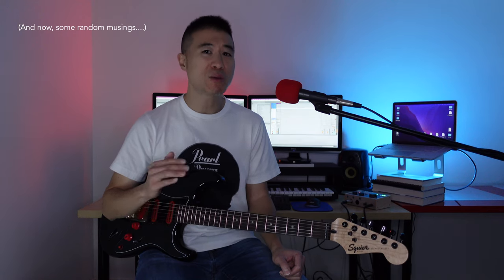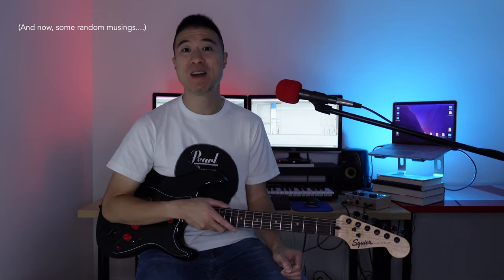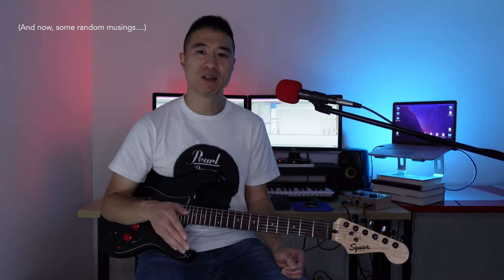The second thing is regarding copper shielding. I was initially under the impression that copper shielding is a good thing regardless. I had success with it on my Tele in my previous video, so I figured I couldn't go wrong this time, but it did. Ripping out all that tape was painful, but it got rid of the noise issue I had. So maybe, just maybe, Dylan Talk's tone was right. Copper shielding might be overrated after all.